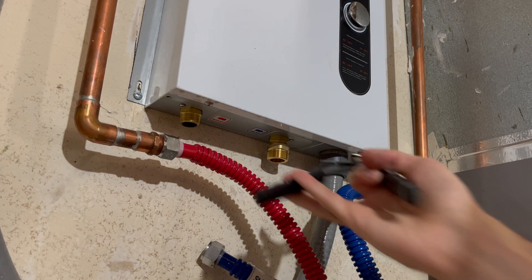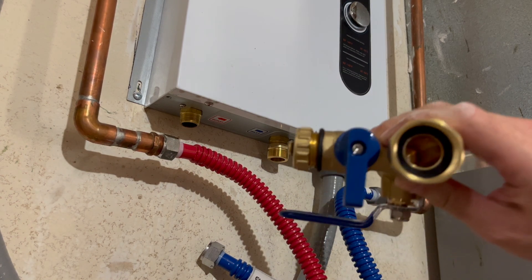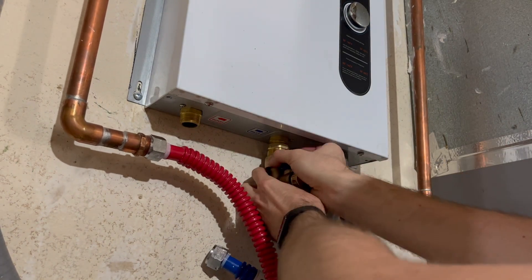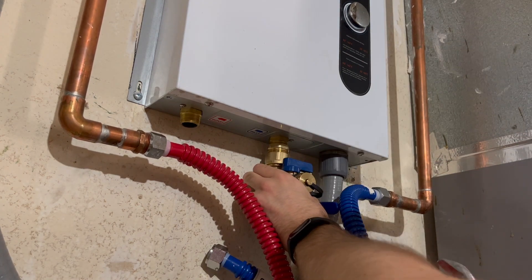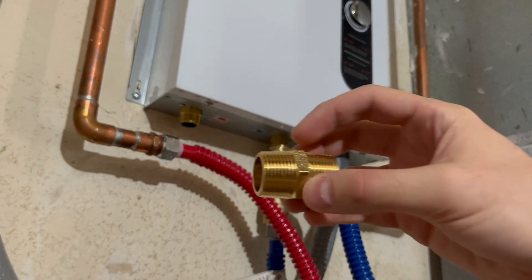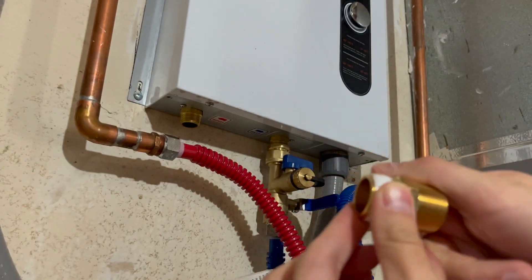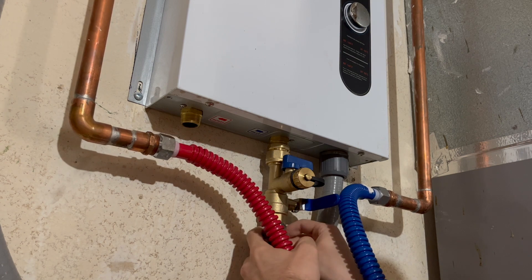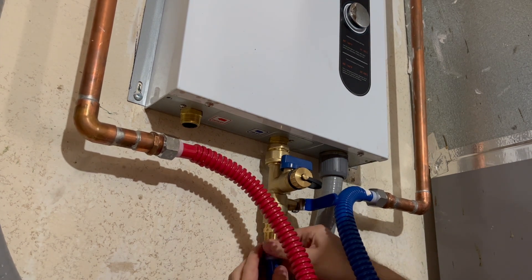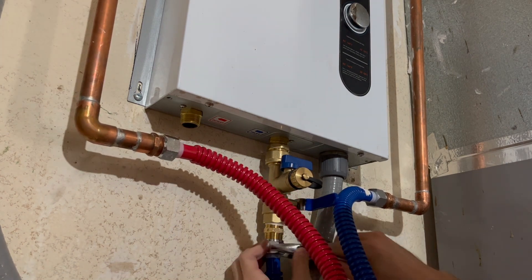Tighten up this part with your nice new wrench. Once you've done that, you can screw the nut on the flush valve to the coupler. This joint is a compression fitting, so you don't need thread tape. Next, because the valve and the supply line are both female connectors, we'll need to add a nipple between them. The top connection is bare metal on metal, so I'll need some more plumber's thread tape. The bottom connection is a compression fitting, so again, no thread tape is needed. Just connect it together and tighten with a wrench or two.